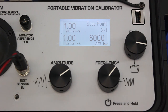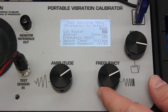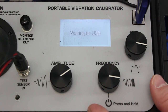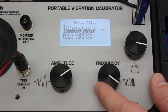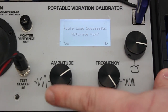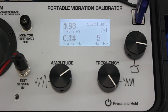To load a new test, we take our USB — on which we saved our calibration route — insert it into the top of the shaker, and press the frequency dial. Then rotate until you see Test Settings, highlight the word Off next to Cal Route, click again, and select Load File from USB. The device will read the USB and now we can select which test we'd like. I choose my velocimeter route, press Frequency, and it asks if I want to load this semi-automated test and execute it. I say yes, and now the velocimeter test is loaded.